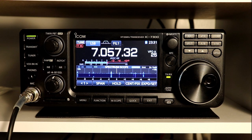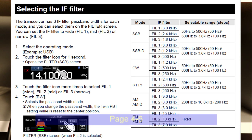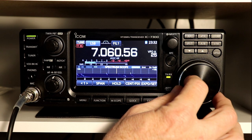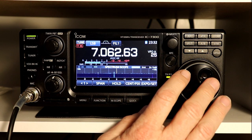If you take a look at the manual page, you will see a table here that shows the default filter bandwidths, and they're different for each mode. For sideband and sideband data, they're slightly different. CW is narrower. RTTY also has narrower ones. And then the AM and FM filters are both much wider, because those modes are much wider in bandwidth. I'm set to lower sideband right now, but we're listening to the CW portion of the band.